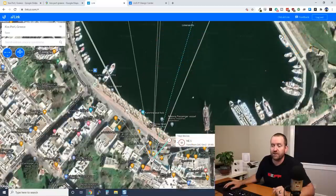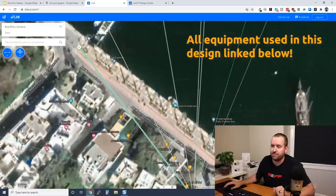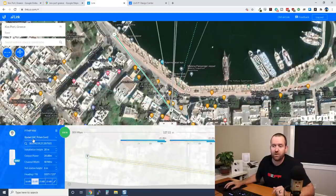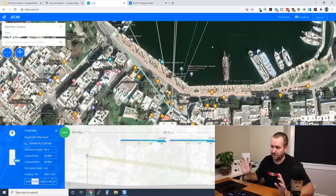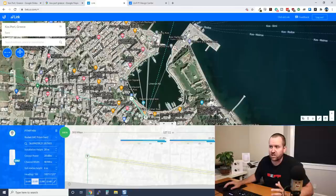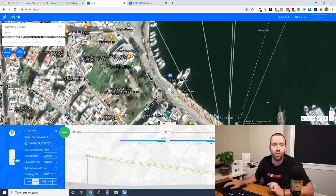In order to get the strongest signal, we're going to use two 90-degree sectors side by side, which will absolutely cover everything. At each station side we're basically going to have a Nanobeam AC Gen 2. The access point is a Rocket 5AC Prism Gen 2, and I'm using the AM5G20-90 sector antenna. On the station side we've got Nanobeams — Nanobeam 5AC Gen 2 — using a 40 MHz channel width. Air Link estimates something with super clear line of sight will get about 300 megabits, though in reality I'd expect 150 to 200 megabits, which is more than sufficient. Each antenna could do 100 to 150 megabits, which is plenty to give Wi-Fi to the boats in the port and people walking around.